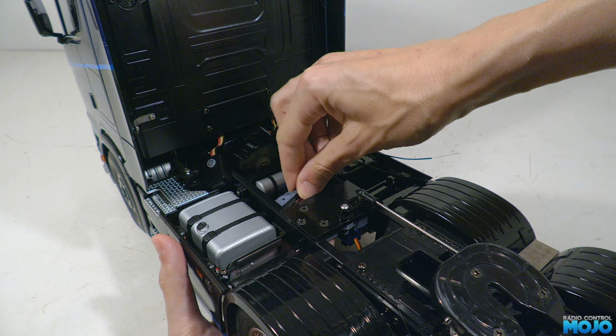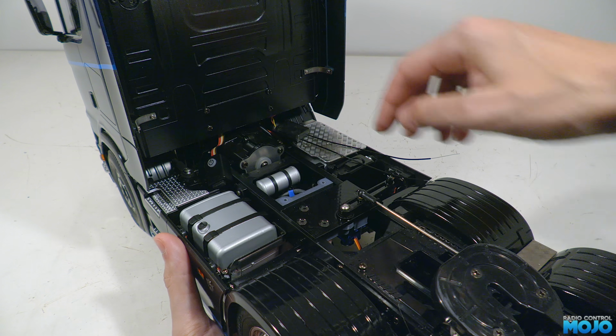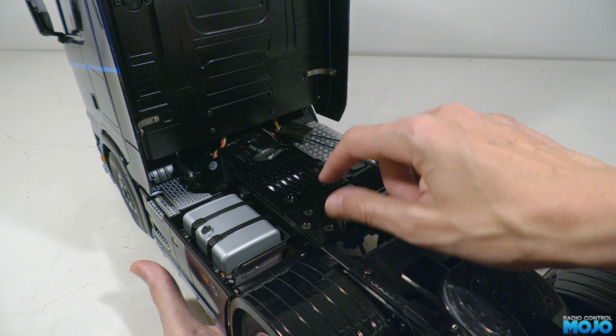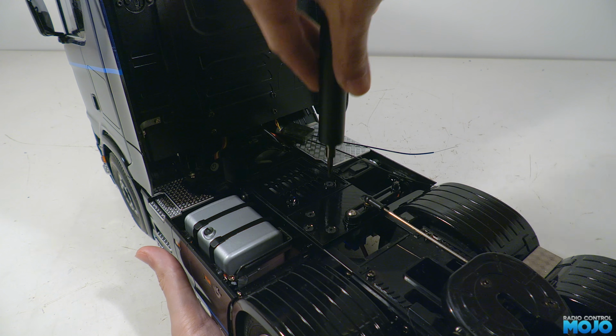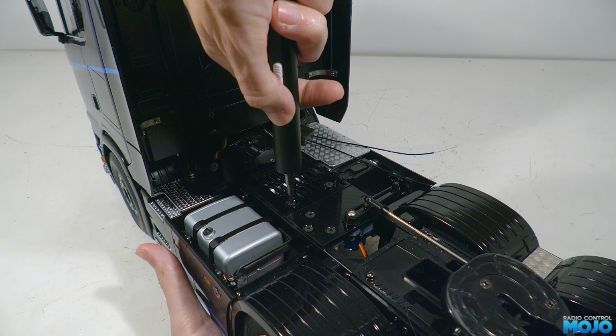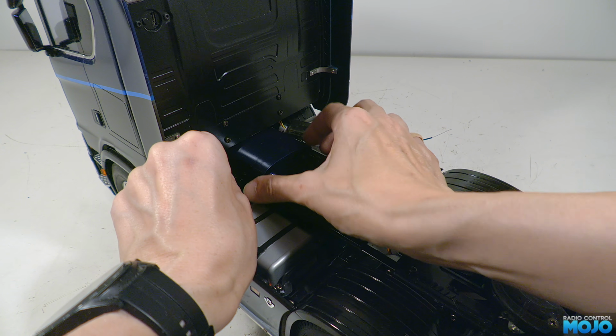The clamping parts have a step on the ends so they fit snugly between the chassis rails. We offer one up inside the chassis and hold it in place from underneath. The top of the clamp is just below the top of the chassis rails, so when we fit the plate it'll grip and stay put. The idea being that we don't want to drill lots of holes in the top of the chassis. The gearbox cover slides over the gearbox and we use 2 more M3x6 countersunk screws.